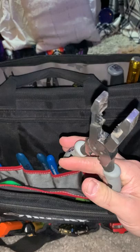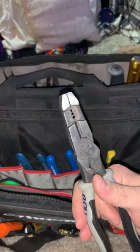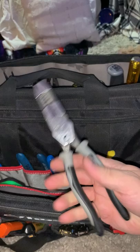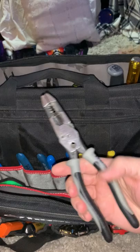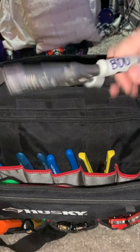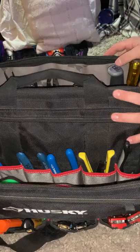These are the Klein multi-purpose pliers — they've got an almost linesman-style head, strip 10, 12, and 14, have a side cutter, bolt shear for 6 and 8-32 screws, a crimper on the back, and fish tape pulling. They come with the Journeyman series handles. I used to have most of my stuff in Journeyman series and I'm kind of going back to the rubber-dipped style. I use these a ton — definitely one of my favorite pairs.